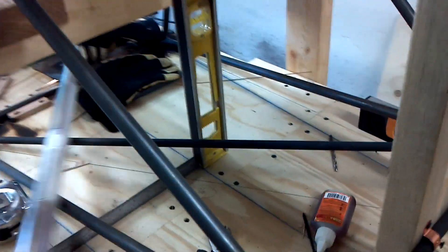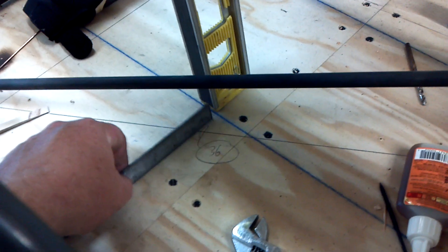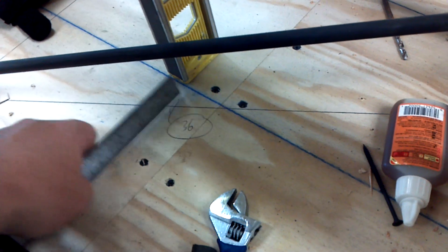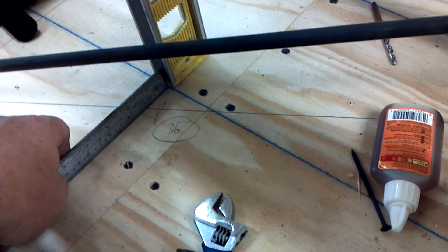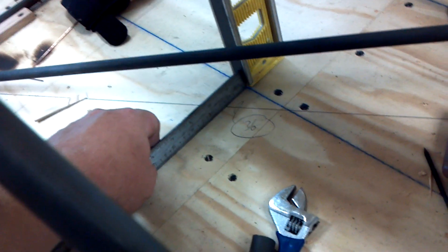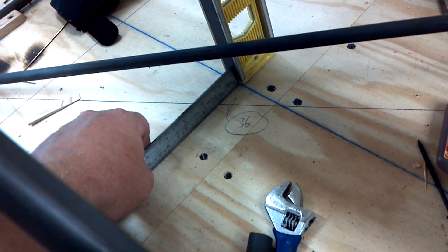Like I said in an earlier video, that line is like 35–40 thousandths. So nothing fancy. The bottom of the level is plastic and it's got a little radius, which makes it hard to bring onto that line. So I just take this and bring it right up. I want to make sure I land in the middle of that blue line, so I'll be close to center — within probably 15 thousandths, which is pretty damn accurate.